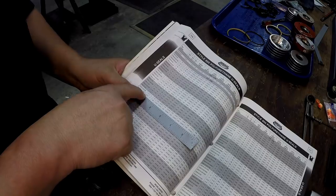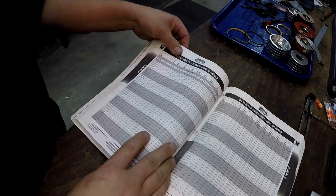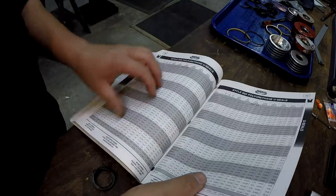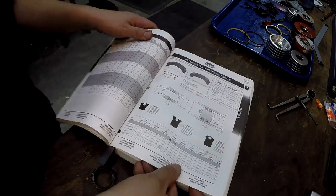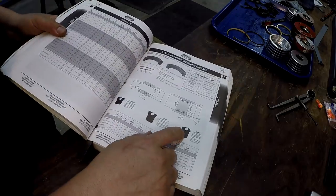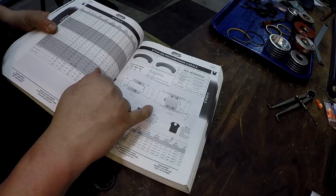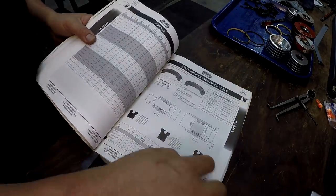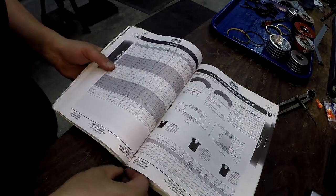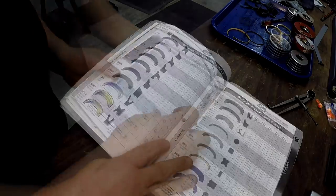By the way, I'm going with the B designation on the end of the parts there. And you have a B, you have a D. And I'll show you at the beginning right here. All right, so you have type B, which is like beveled there. Then you have a sharp V on the end. That'll be a D designation. And I like the type B better. It's gonna be the same seal, give you the same performance, a little bit easier to work with.